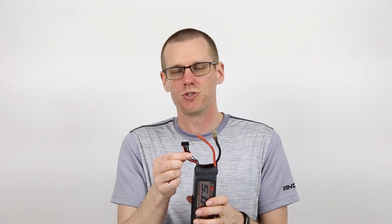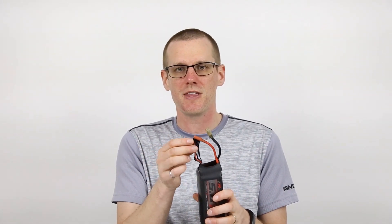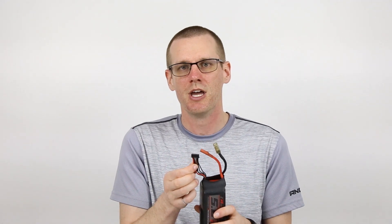So how else can you tap into this extra connector found on your battery more easily? What I would recommend if you really want to use this voltage tap is to get a specific connector that plugs right into your existing one. Don't mid-tap the pack — don't take a partial voltage of the battery. What you want to do is take the entire six cell pack and tap right from all six cells at the same time. Then you can put a voltage regulator, one that is very commonly used to power receivers. You can usually change the voltage from at least five to six volts, and if you get a better one, from around five volts all the way up to about 12 volts. Castle sells these types of voltage regulators.